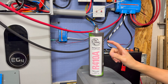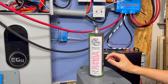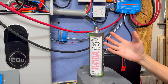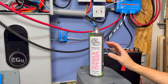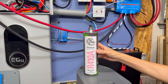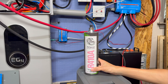The important thing to do is make sure you look on the side of your outdoor unit to figure out which type of refrigerant you're using. In my case, and in a lot of the Mr. Cool DIY mini split cases, they're all using R410A. R410A refrigerant is pretty common to find. You can get this, but I do want to emphasize a little bit of caution — you want to make sure you get the right refrigerant. I also encourage you to get the bottle that has the UV dye and the sealant, especially if this is your first time doing it.